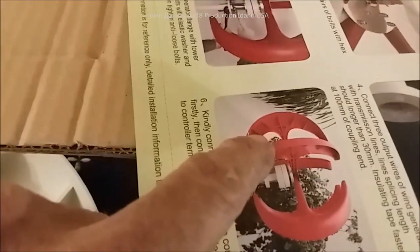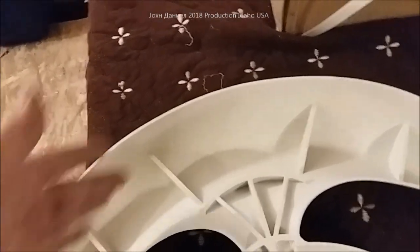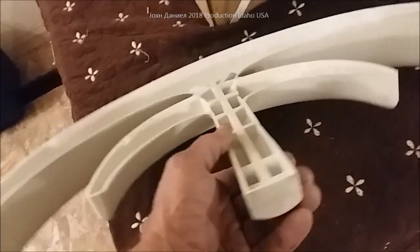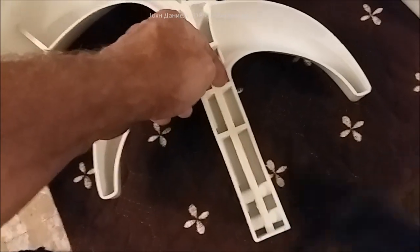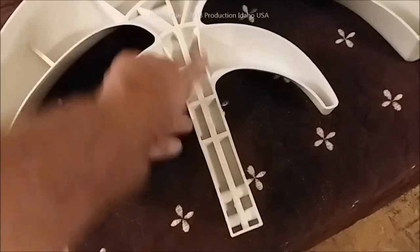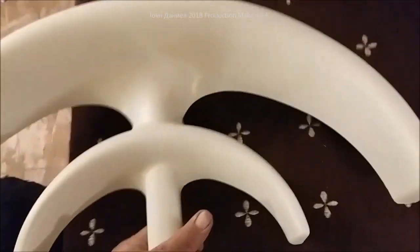Look at the way these are built - you'll see the mass webbing here, and then the webbing is a little less so that you have less vacuum effect inside your blades. These are blades for a VAWT - V-A-W-T - which means vertical wind turbine. I believe I want to cut a piece of aluminum to fit down inside here and get them all equal length and equal weight to either strengthen it up or keep out snow, rain, mud, or dust, because that would really throw you off balance. It doesn't move fast enough at the center but moves a lot faster at the outer edge.